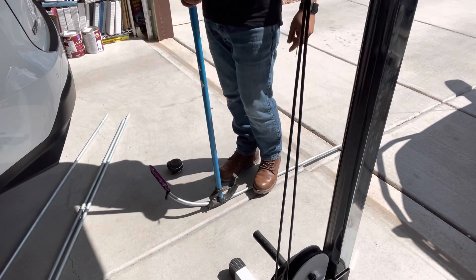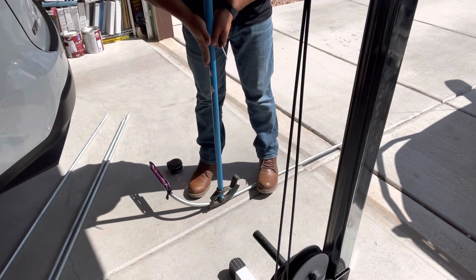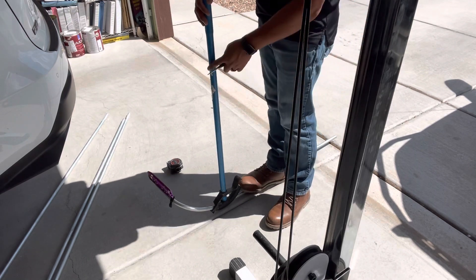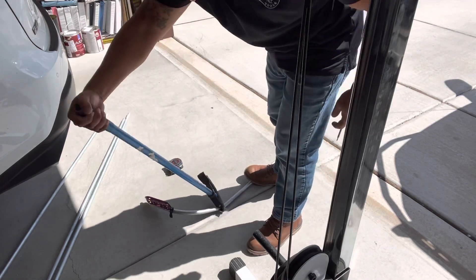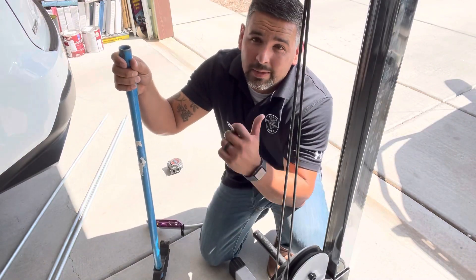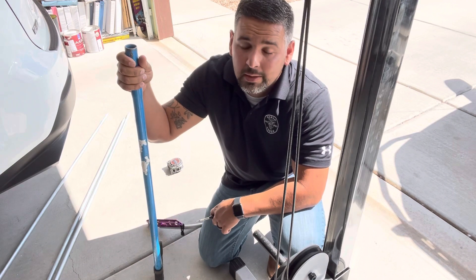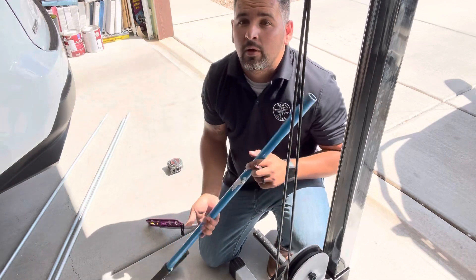That's how you guys do a kick 90 with a 30-degree bend. Remember, at this guy's level, that's 30 degrees — kind of a weird little trick but it works pretty good. That's if you have a straight run too, just FYI. Thank you guys for watching. My name is John Spear, I'm with Warhammer Electric. Please like, subscribe, share — check us out on YouTube, Instagram, LinkedIn, TikTok. We're on everything. Hope you guys have a great day.